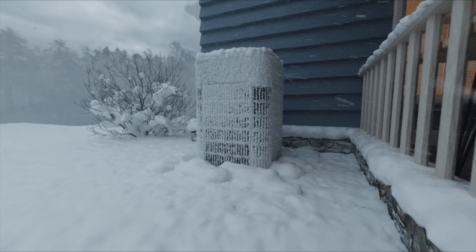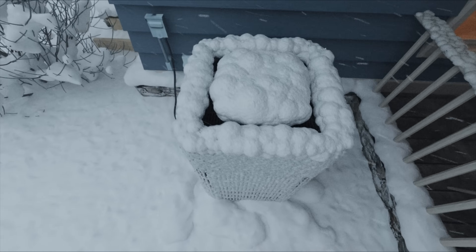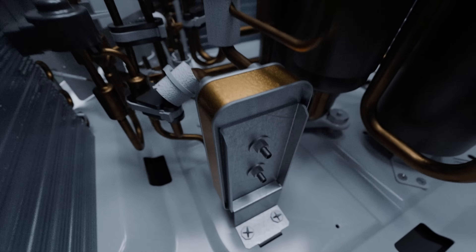The new Bosch IDS Ultra features an innovative technology called Enhanced Vapor Injection to enable efficient heat pump operation in cold climates. Enhanced Vapor Injection is enabled by the addition of a plate heat exchanger, an additional electronic expansion valve, and complemented by an inverter compressor.